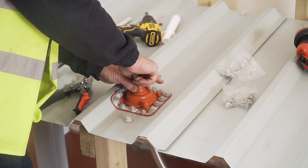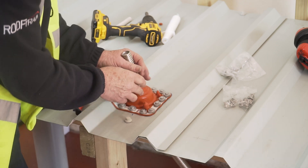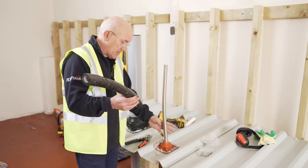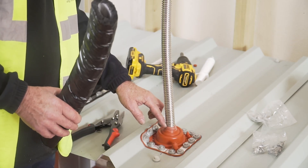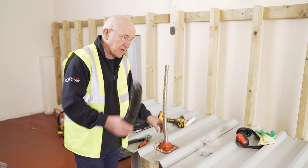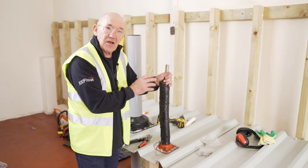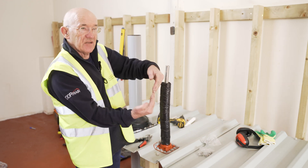The plumber has passed up the solar thermal pipe and I can now pull this up through — you can see how tight it is around there, that's a very good seal. The plumber passed the pipe up; he will insulate the bottom. On the top, the pipe that's exposed needs to be insulated as well. The pipe goes through the rubber — you don't want insulation going through the rubber as the connection will not be watertight. The insulation must be on the outside, touching both sides of the Decktite but not going through it.